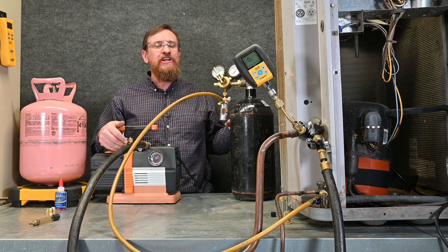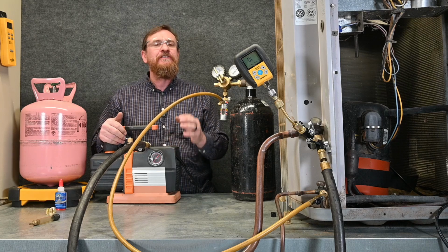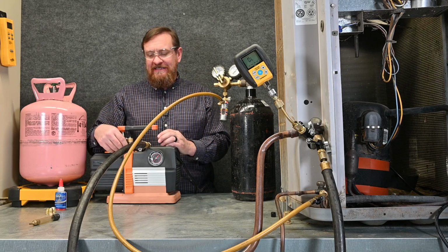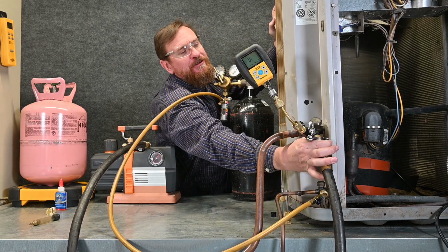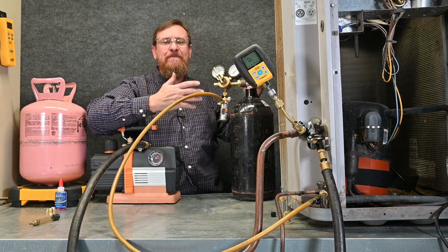If I put too much pressure, it can actually cause the water vapor to condense back into a liquid back on these surfaces. So by keeping it in the vapor form and just smoothly flowing out helps. Next thing I'm going to do is put this cap on, and I'm going to close off the suction valve to my vacuum hose. Now I'm adding a little bit of pressure. I don't want too much, maybe about a pound or so.